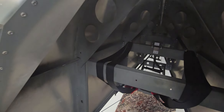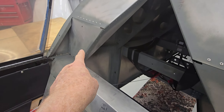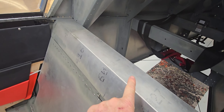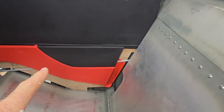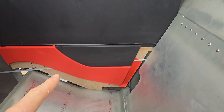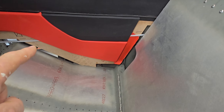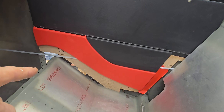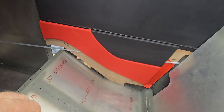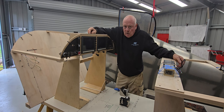So we've got the transponder, transceiver, and flap controller directly underneath there, and if you look through there you'll actually see where the SP6 is. The cable route will run along here inside, and inside there will be the headset jacks. The cable route runs along here and then drops down to pick up the flap controller. Just where that rudder cable conduit is, it runs all the way through there — I'll follow that same route for the cables. Alternatively I can come out this point down here and lay them in a black conduit under the seat pan, which is probably the better way, depending on the thickness of the cables.